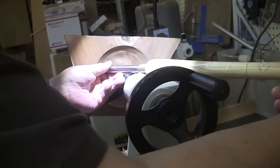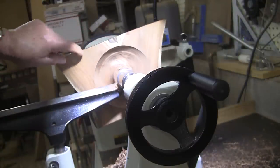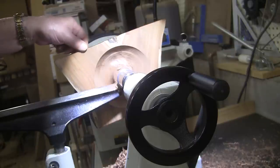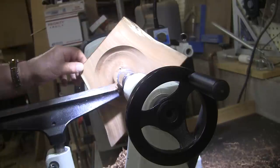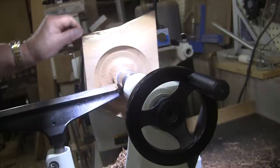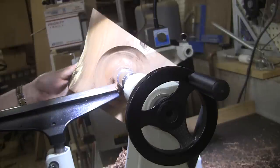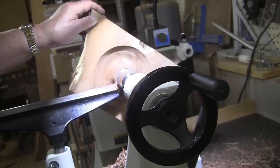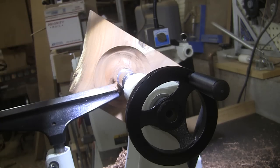You really want to be clear over there. I also noticed these cracks — I think I pointed them out at the beginning. Maybe you can see this crack right here, it only comes down about a half an inch on the bottom side. Over here there's another one, and they connect. So I'm a little bit concerned about that. They don't connect on the outside at the bottom of the bowl, so I think we're okay. We'll turn through it mostly — but anything can happen.